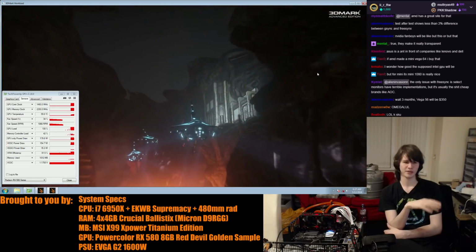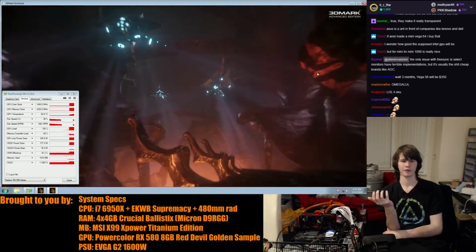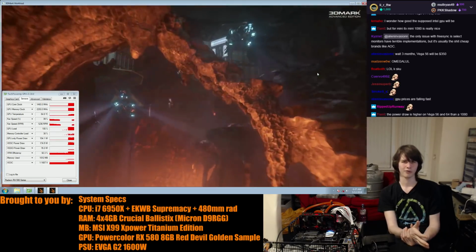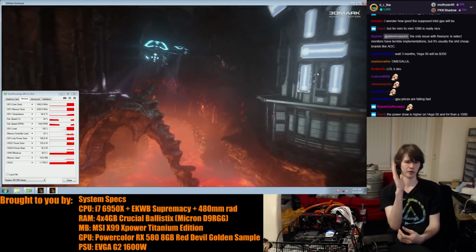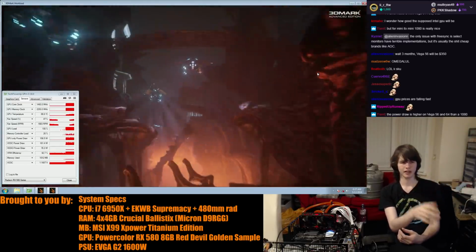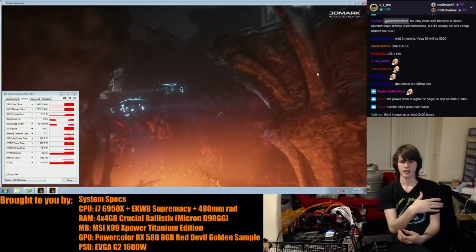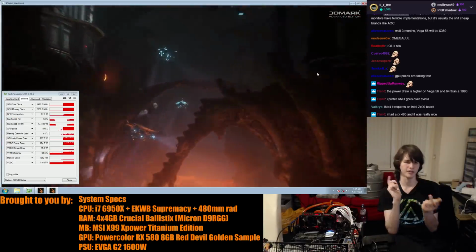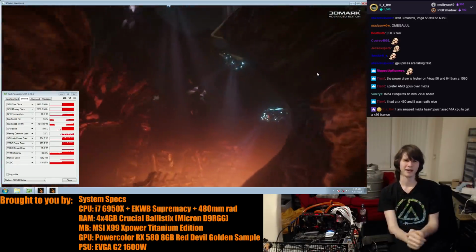If you look at Intel CPUs and the K SKUs, it's like you pay $20-$30 more than the non-K CPU, and you get overclocking ability. That's not really a big deal. And in terms of actually supporting overclocking, Intel is really helpful to some extent. Yeah, it sucks that they have the whole K SKU non-K separation going on, but compared to the kind of support you have for GPU overclocking, the amount of access you get in Intel BIOS is ridiculous. You can turn off all the power limits, change the power limits, change how long the power limits last, you can change everything, right?